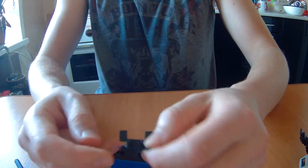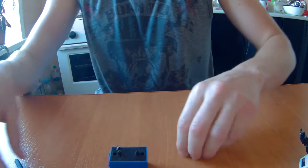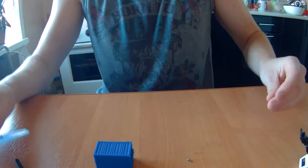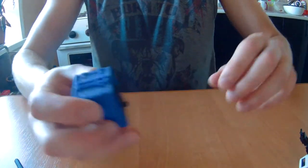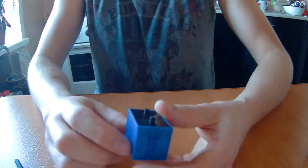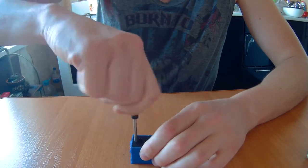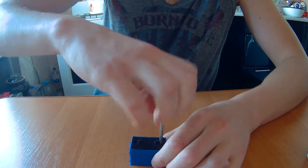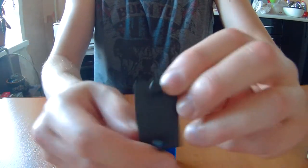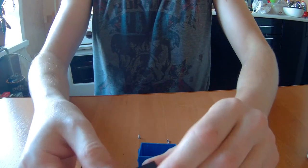The duster — I think that's the correct name — is a not-so-difficult injection molding plastic part. There are two screws for box connection, two millimeters. This consists of a front end cap and base. The box also consists of two parts. The box base is a simple injection molding part with one millimeter thickness — an open/closed mold without any difficult production requirements.